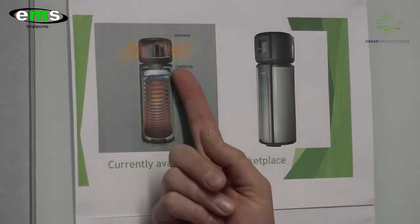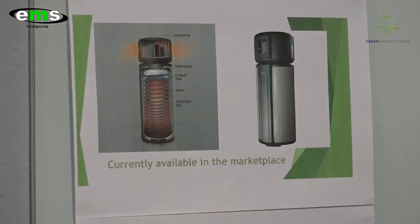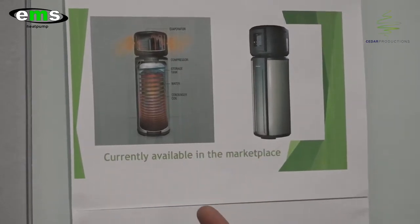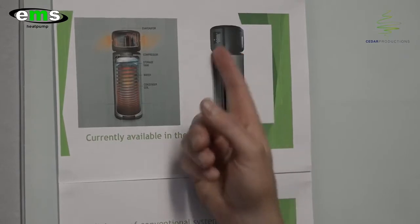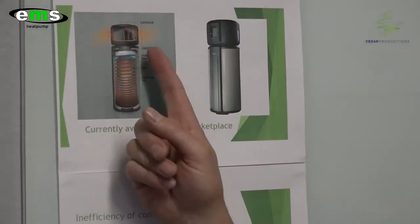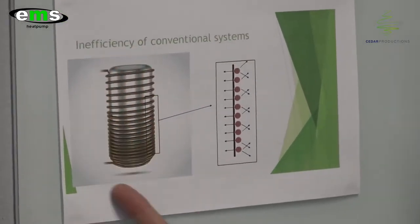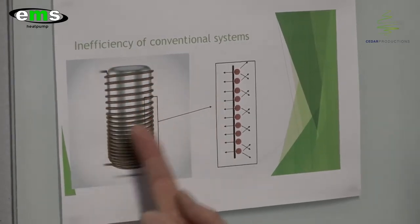To explain this in simple terms, if you look at this diagram here, you can see there is a high pressure vessel inside this unit, which first of all is an explosion risk. It works like any conventional hot water system or geyser, fitted to an integrated heat pump system. The black head on top is where the heat pump section sits and the bottom half is where the actual tank cavity is. The water is heated through the condenser coil, which is wrapped around the inner tank like a piece of string. There is an enlargement of that inner cavity showing the stainless steel tank — they use either stainless steel or mild steel — and copper coils wrapped around the tank.